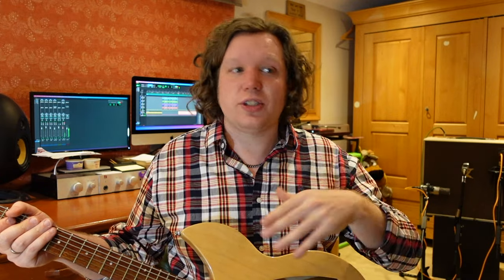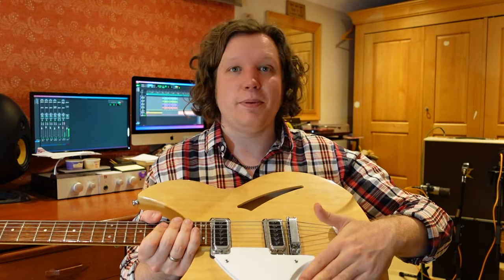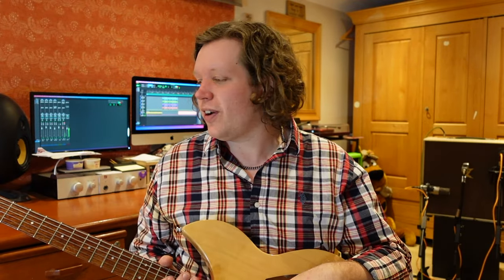But overall, I really don't think the vintage configuration of pots made the guitar sound brighter and more chimey at all. If anything, it sounds a little bit darker and quieter. Now, on paper, that would make a bit of sense because on the volume controls especially, which tend to have a larger bearing on the sound of the guitar in terms of what value you put in there, we were going from 330k down to 250. Or actually, these are the VI pots I put in here and they're 10% overvalued. So they were kind of 280, 290k, but still a notable reduction in pot value,